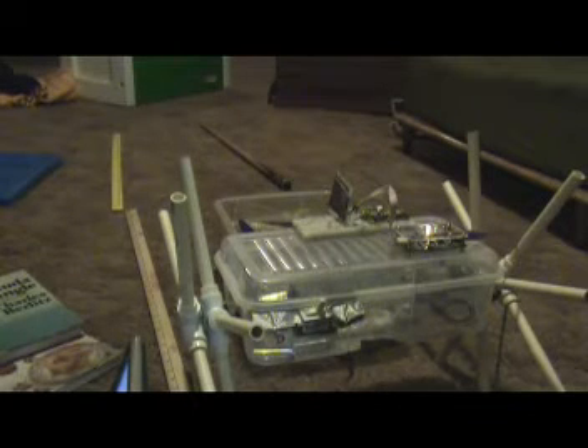This is really good for us because we don't want to detect the ground with this sensor, or small objects such as a 7-inch obstacle which this robot can climb over. We want to be able to detect bigger objects which we should go around instead of climbing on top of. So this is exactly the sensor placement we are looking for.